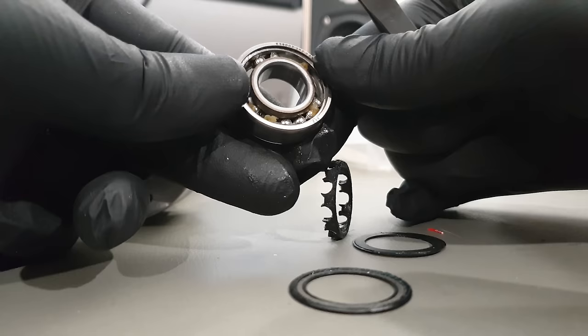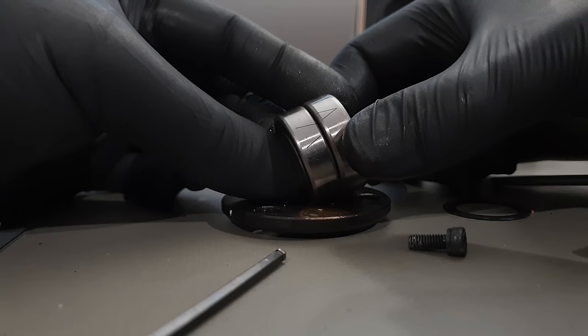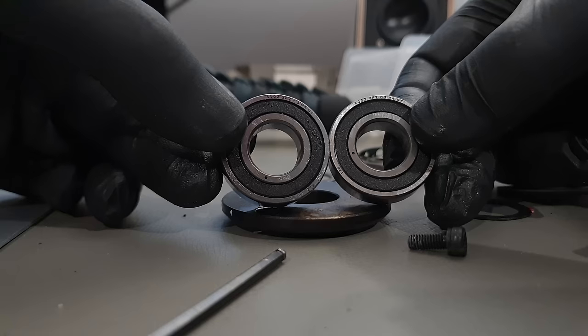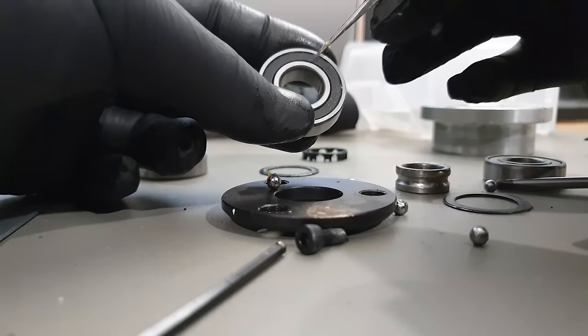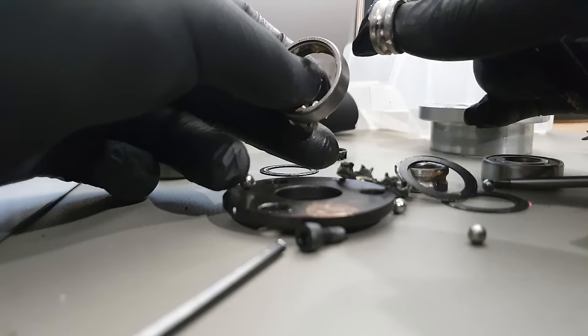The first one on the connector side of the spindle is just a single normal radial ball bearing, and that's okay. On a CNC spindle, however, axial forces can easily exceed radial ones — so just like with our ball screws, a fixed bearing block is needed. At a cursory glance it looks like it's right here, equipped with a pair of angular contact ball bearings. That would be beautiful. But in reality they've just disguised two more regular, not even deep groove ball bearings. Disappointing — and good riddance.